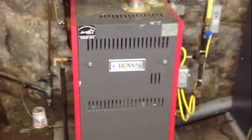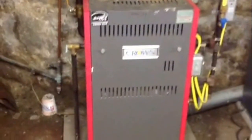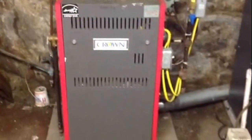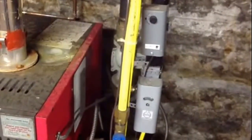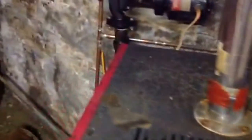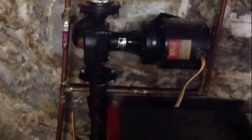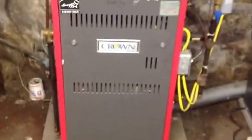I want to show you the basement part of a steam converter in the hot water heating system. We have an 85% boiler here. We added a couple of controls on here because the boiler was a little too big for the application. We also added a larger pump to move the water a little bit better. This is not the location of the original steam boiler — we moved it because we wanted to get the flue to a place where we can get it outside.